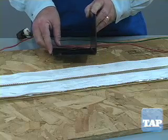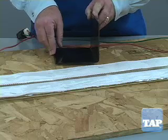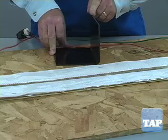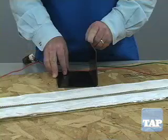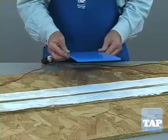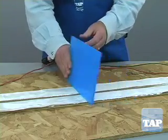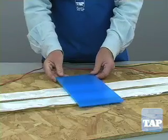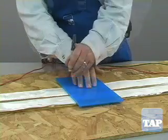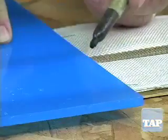For right angles, you can use a jig and clamps to hold it in place as it cools. The whole process only takes a few minutes, so watch it closely. For one quarter inch and thicker material, the piece can also be flipped to heat more evenly. Just make sure you are heating the exact same place every time you flip the piece. This can be done by making a small mark on the edge where the bend is to be placed.